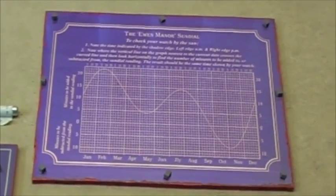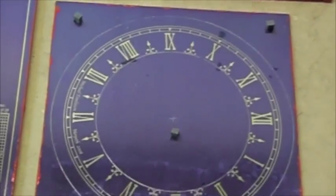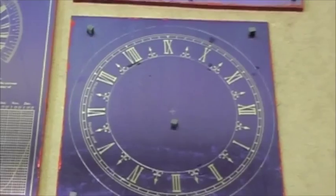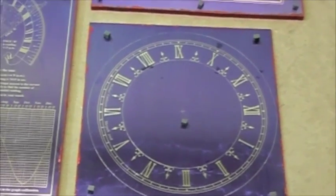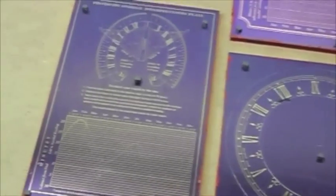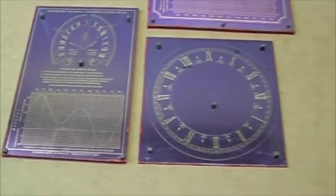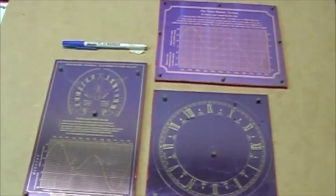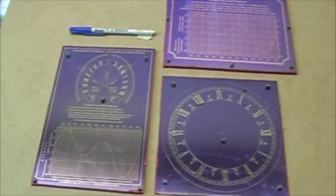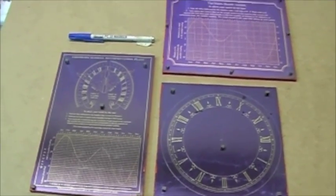Can you see that there are little perspex blocks glued to the surfaces? Etching is done face down, and if you put these face down they'll lie on the bottom of the etching tank and that would stop the etching solution actually getting to them. Just sticking on little cubes of perspex with super glue does the job very well and allows the etching to run underneath quite freely.